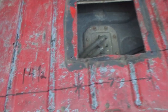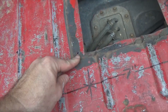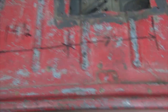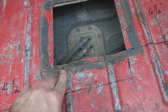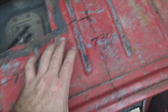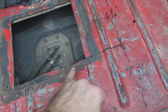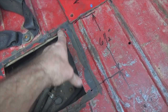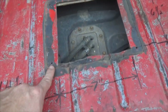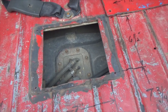Just to recap one more time: fourteen and a half inches from the edge of the tub — make your line. Seven and three-quarter inches from here this way — make your line. That locates your corner. From that corner, making sure you're square with the body, come over and measure another seven and three-quarter inches, draw your line this way. Seven inches across — draw your line. That intersection will be your bottom corner. Then, making sure you're perpendicular, six and a half inches this way — draw your line. Seven inches across. Then six and a half inches tall on this side. Connect the dots between the two and you're good to go.